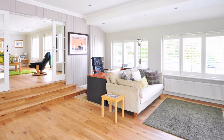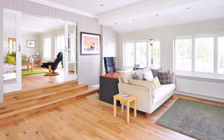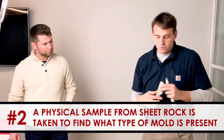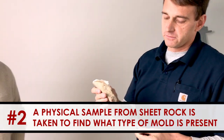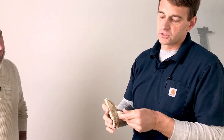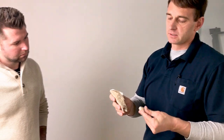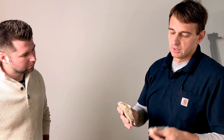We want to make sure that the inside air counts are lower than what you're breathing outside. That will tell us a lot about your overall indoor air quality in your living space, especially in the bedrooms where you're spending most of the time. The second type of testing is to actually take a physical sample — if you see black or green on a piece of sheetrock, we'll take a swab and swab it to see the type of mold and the health effect. If it's Stachybotrys, that's something that can be toxic and a health-related issue. It goes off to the lab.